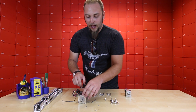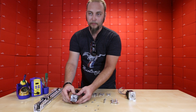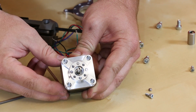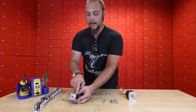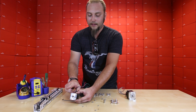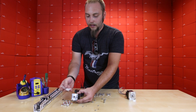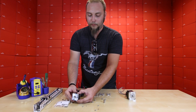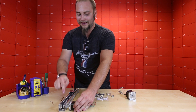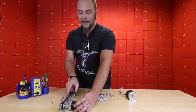I'm going to show you how this works assembling the bracket, but using this smaller stepper motor. You can see I've already attached the bracket to the stepper motor. With the smaller size, it actually comes with four Phillips head screws that come from the front of the bracket and go into the stepper motor, because these motors have threaded mounting holes on the front of them. Now I'm going to remove those, take this bracket off, and go from the back connecting the standoffs from this bracket so that we have the clearance we need from this drive shaft to an adapter coupler onto the same drive shaft we were using for the larger motor. Now that I have my bolts connecting the standoffs to the channel, our smaller stepper motor is connected to this linear slider, which can now be positioned repeatably and accurately by the stepper motor.